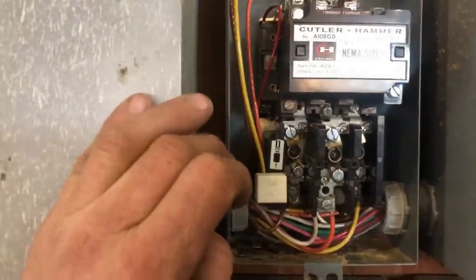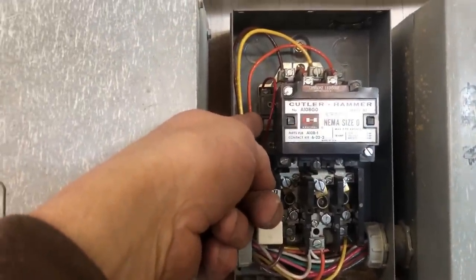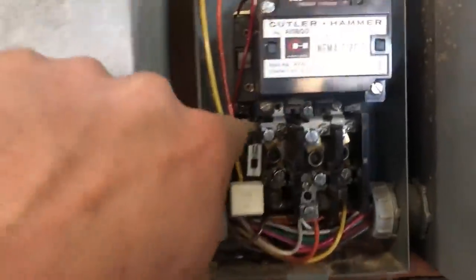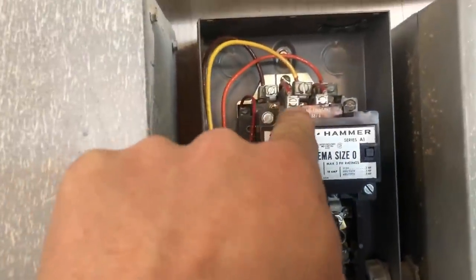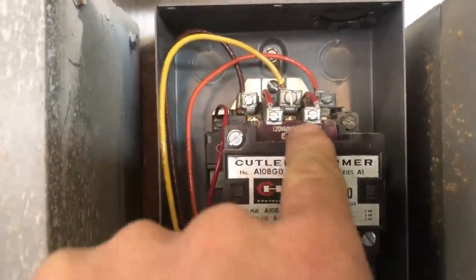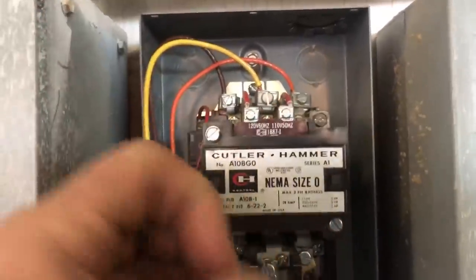On your pilot side, you've got a wire down here on the side of your starter — that's your auxiliary contact. So when you push the button, the black wire in there gets hot. See that black wire in the back? There's a wire that comes straight off it and comes up here at the top of this coil — that's your hot. On the other side is your ground. Here's your hot and there's your ground, and that ignites the coil.